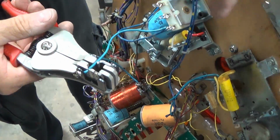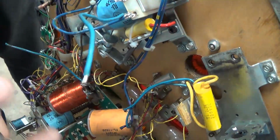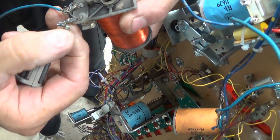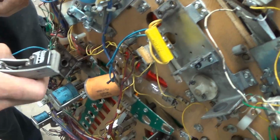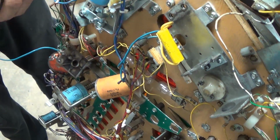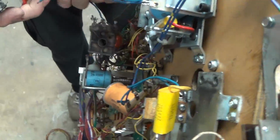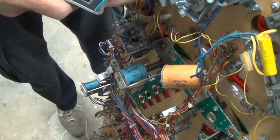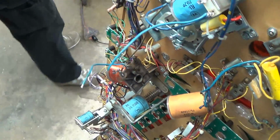Now this is a single wire going to the end of stroke. You only want about that much off. You see people do this, where they have too much hanging off bare, and it's just sloppy looking. You don't need that, because the bare without the vinyl on it serves no purpose except to short. You want to keep your vinyl close to the termination end. It doesn't mean anything performance-wise, but it's just a nice practice. If you're going to do it, be neat about it.